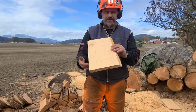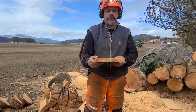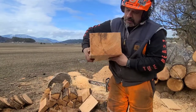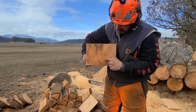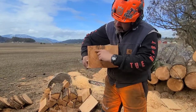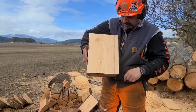I hope this is kind of making sense, but that separation is going to happen. A good mill person can mill around it, because they would probably mill right to the heartwood. You see, it's going to happen all the way down the tree. Right there is your line, right there is the circle. So it's going to keep happening. If I cut another one, I'm going to lose this much wood off the side of it. A good mill person could probably mill around it.